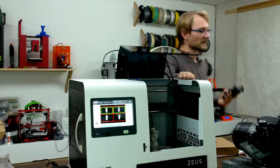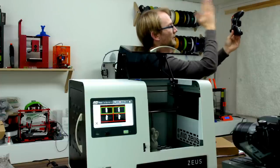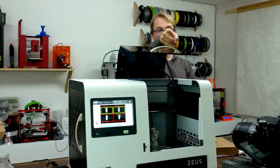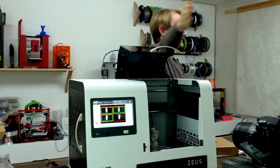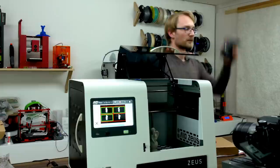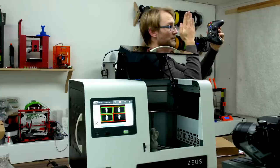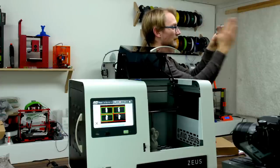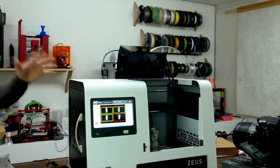What this one is doing instead is creating four independent scans. Let's say you aligned this to the front, it's taking the scan from this side. If you are the scanner camera, it's actually got a laser that's coming from a bit off the side. As the scanning object rotates, it's going to see how much that laser line is offset. It's going to swipe the laser across from that offset position, then rotate the part, take another scan, another swipe, rotate it again, and then combine those four scans into a single one. And that's what it's doing right now.